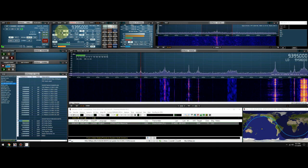Considering that we're at the bottom of the solar cycle, it's not that bad, and I got to give credit to the antenna being used. Because without using a proper antenna for HF, you're not going to get a decent signal-to-noise ratio — you're going to get a lot of noise. So if you guys are using indoor antennas, get those antennas outside. Get a wire out there as high as possible, point it northeast-southwest. Just be safe when you erect an antenna — be aware of any electrical power lines, please. And you should notice a dramatic difference.